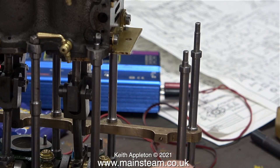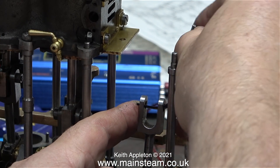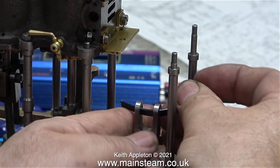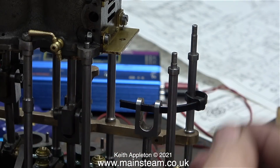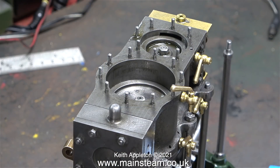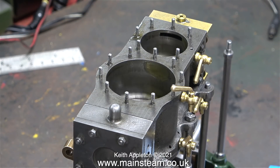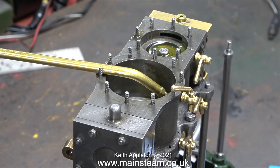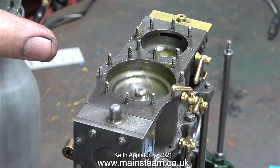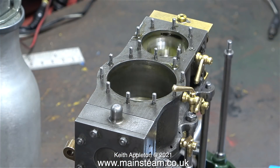When I turn the crankshaft by hand I can't tell you how well it feels — it's very firm, a little bit scratchy sounding as it would be. Very shortly I'm going to rotate the crankshaft using my electric drill, but I can't do that if this connecting rod is not in the right position. I'm just using a cable tie and it does the trick. Before I run the engine I need to apply a lot of oil to the cylinder bores. These are brand new rings. This is compounded bearing oil from a company called Hallet Oil, formulated for steam engine bearings. I spread the oil around both cylinders using my finger. And now ladies and gentlemen, I give you an engine with piston rings.